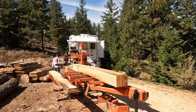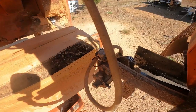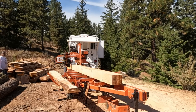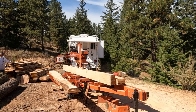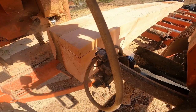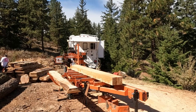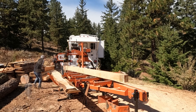Fortunately, these are milled over. If I had caught it at the time, I would have gone ahead and maybe taken something out of the middle, or shifted it over, or told the customer I wasn't going to be able to make the two beams he wanted out of this log. Customers often say what they want out of a log, and all you can do is advise them on the best way to mill it. If you do something like this, you advise them: hey, I've got pith a little too close on this one — do you want me to mill that off, turn this into a 4x8 or something like that, or leave it?